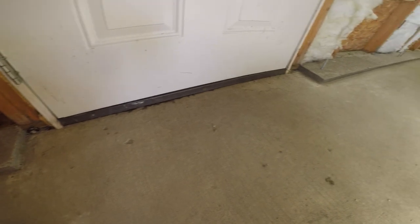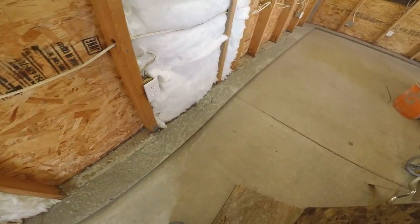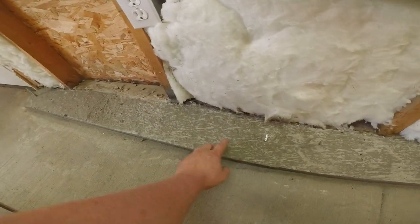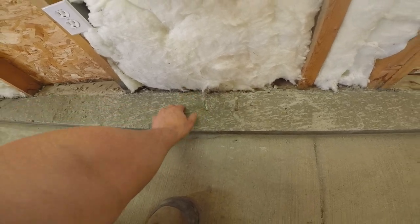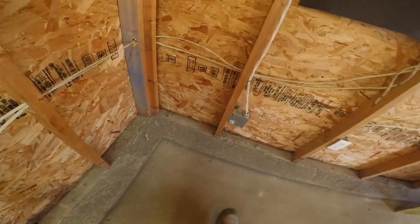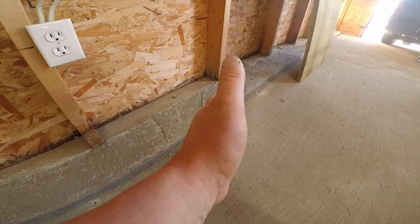Right at the doors is perfect — see that? That's gorgeous. The rod starts two inches in from the ends and then in the middle, and we're going to pin-bolt it down. You can see right here where a 10-foot piece of track will end, and the cut will be from here to there — it'll have two rods as well. I laid it all out on the steel angle we were using. I'm glad we did the rod because I don't think I'm going to pin-bolt this down for a while — it still looks a little wet. Look at how sharp the corners turned out. The edge is beautiful. The steel angle looked a little wavy before the concrete was in, but when it was poured it all stiffened and tightened up straight.